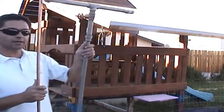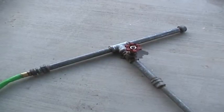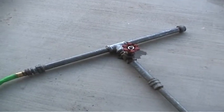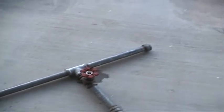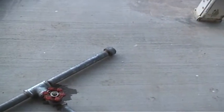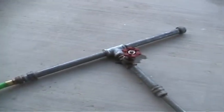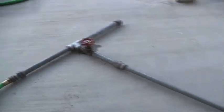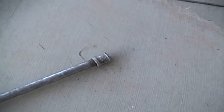Or you can make a water drill like this one. Basically, a water drill is just some heavy duty pipe put together in the shape of a T. The handle has one end capped off; the other end has a hose adapter. You can have a valve if you'd like. Make sure the other end is at least 6 or 7 feet, and then drill some teeth into the end to help dig through the dirt.